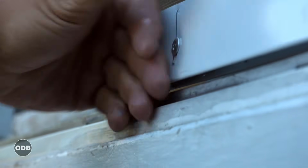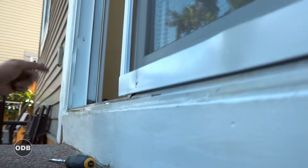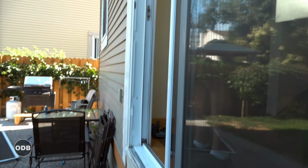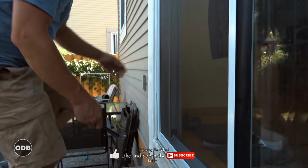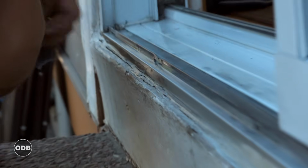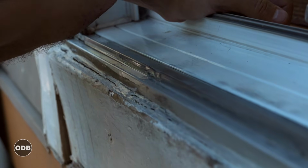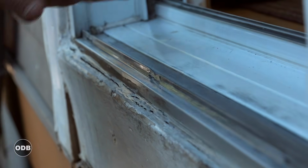Now these wheels are spring-loaded, and so they're good to go. Make sure that before you go back to normal use, you check the track. Door tracks, generally speaking, are made of aluminum so they don't rust, okay? And they can get dinged up out of shape pretty easy. Just get a little hammer, small metal tool, straighten your track back out.